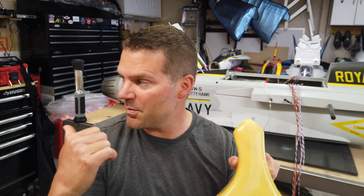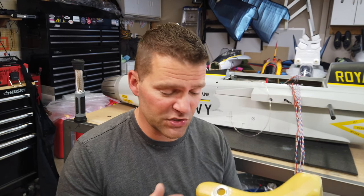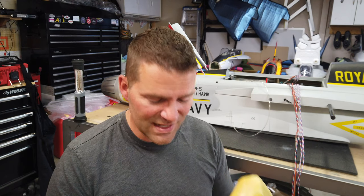A vacuum is not a great idea either because this tank is small but on the main tank it's quite flexy, so you could suck those tanks in and you won't get all the fine stuff out. The best thing I've found is to just put some regular fuel in here — diesel, jet-A, kerosene, whatever you're using. Put it in, shake it up, and I don't like reusing it. I just dump it out with my vehicle oil. So I'm going to put some fuel in all three tanks, give them a good shake, dump it out, put some more in, shake again, dump it out.